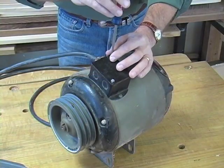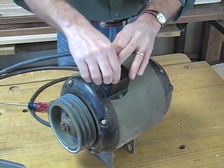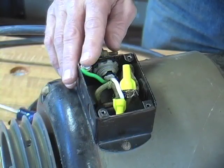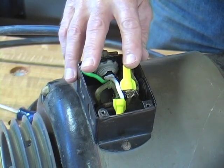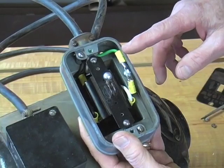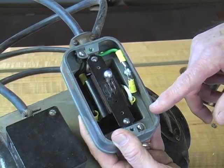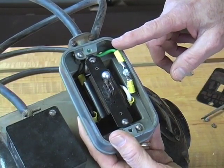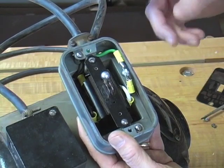So I've replaced the original wiring, and while I was at it, I put in an upgrade. When this saw was made, the ground wire was not part of the plug connection — the motor was grounded to the cabinet. I've added a grounding wire, and you can see it right here. I've connected the motor wire leads so that the motor will run on 220 volt current, though it can also be set up on 120 volt power. I've removed the switch cover so we could take a look inside. I simply reconnected the electrical wires to the switch as they were. It's not enough to connect just the motor to the ground — the cabinet should be grounded as well, and all of that has to be tied to the cord that goes to the wall receptacle.